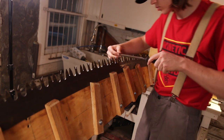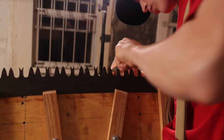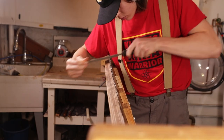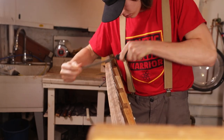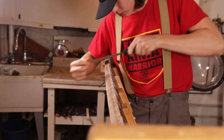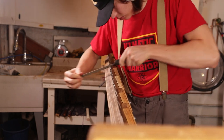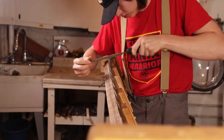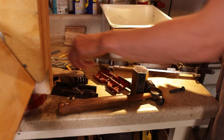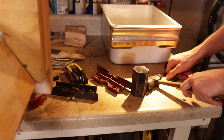It really does depend on the steel, because I noticed that the steel on this saw is really hard, but I still managed to swedge it over well enough. Making your raker gullets deeper also means you have to do less work in the future when you resharpen the saw. You also want to make sure each side of the raker is symmetrical and that each gullet is the same depth. This isn't as important as setting the saw and giving your saw around 12 thousandths of an inch in raker clearance, but it definitely is important.